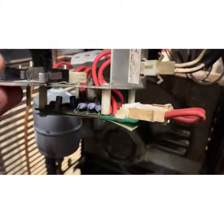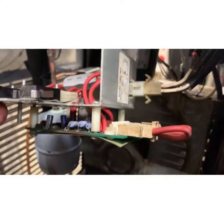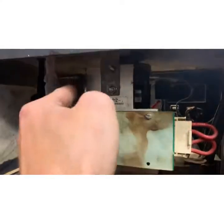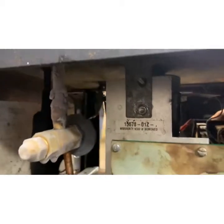So when I turn this on, the unit calls, the compressor comes on, and then when the beater hits, it interrupts it. It's just that simple. Why do we need a $200 computer board? We don't.